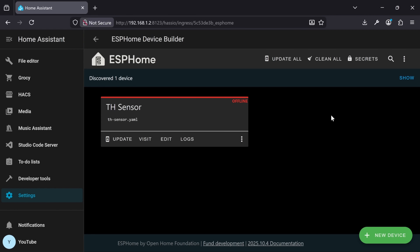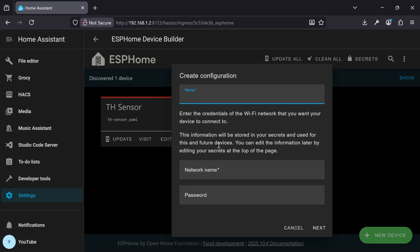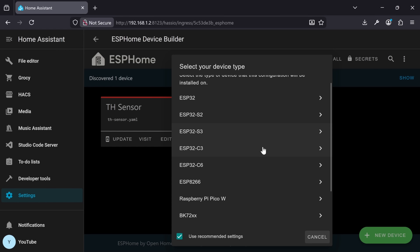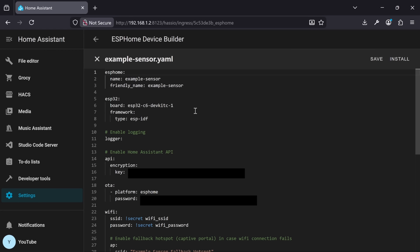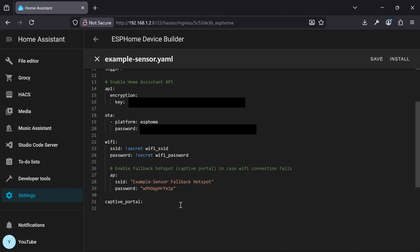Once that's done, head over to ESPHome Builder and add your Wi-Fi credentials. Adding them at this point means you'll only have to type them in once, and ESPHome Builder will remember them every time you flash a new device and pass them to those devices automatically. Next, create a new device and select the ESP32C6. Then hit Skip because we're not yet ready to install anything, then hit Edit. This is where we define the functionality we want the sensor to have — we give it access to Wi-Fi credentials so we can report sensor data wirelessly, and later we can even push config updates over Wi-Fi as well.